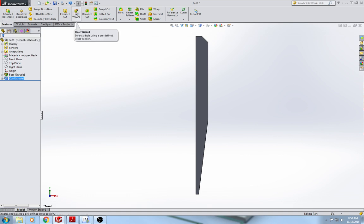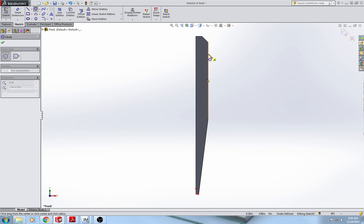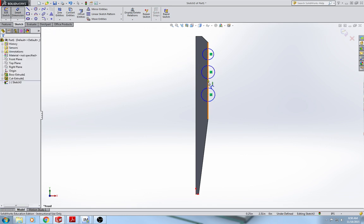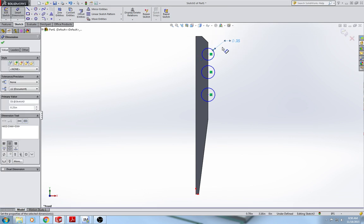So I'm just going to go to extrude cut, select the front surface, circle. I'm going to draw 3 circles on the edge. Make sure you don't snap to any reference geometry that you don't mean to, such as a midpoint right there. Don't snap to that. And then we can put in our dimensions, 0.25,